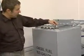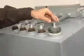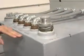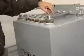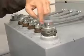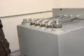On the day tank we also have a manual float gauge, and the system is designed to operate between three-quarters and full. So under normal operation, in your daily checks you would check this and should see it between three-quarters and full. If you had an overfill or a low level condition, you would also see that on the gauge.